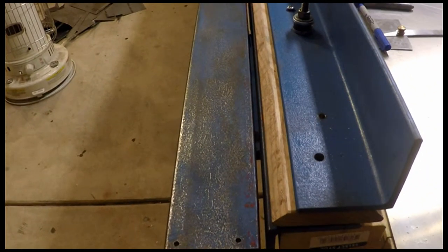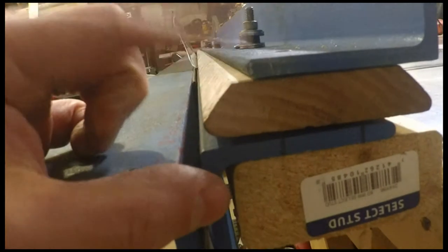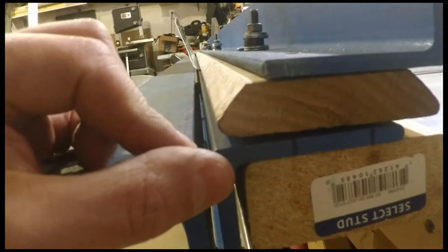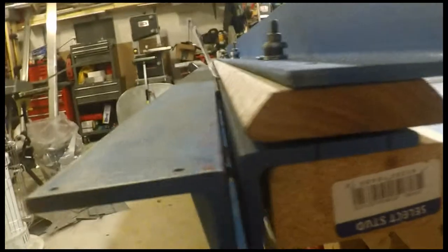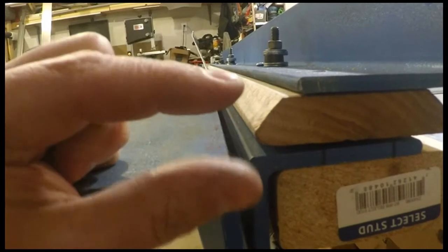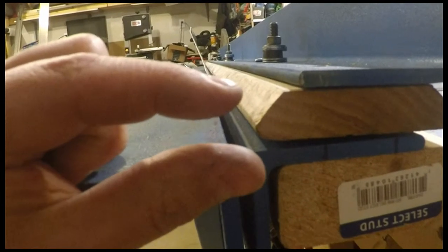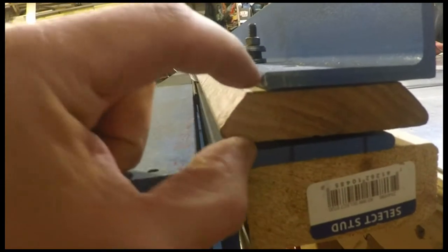So the other thing that I want to point out, if you do a bending nose like I've done here, if you do a shoe and you do a quarter inch round and an eighth inch round on one side, instead of using just this surface as your bending nose, when you're bending some of your tighter channels, like a piece of U channel that has a fairly small width to it, it's really difficult to do that because of the height of this thing.